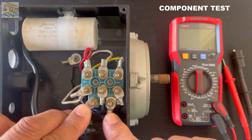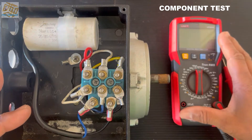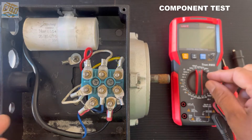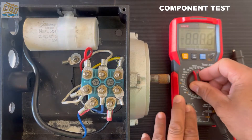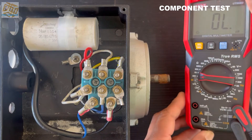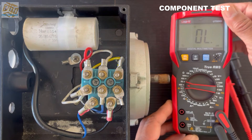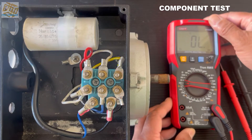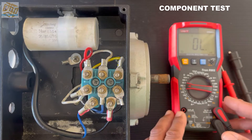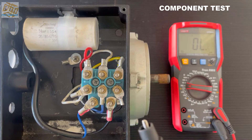That's about the only thing we can confirm with the eye. Let's see what the multimeter says. I would choose a particular range to start off with — I'll look for my own scale and put it on the 200 ohm scale. Most multimeters have 200 ohms, but in this case I have 600, so I used it on the 600 ohm scale.